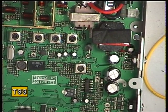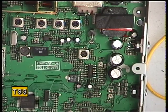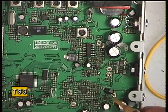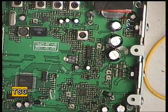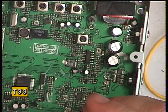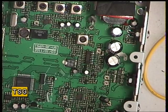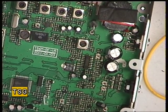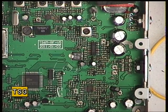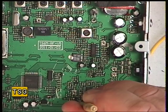The only other thing we can do is the deviation. This radio is never going to be used in AM. I think the adjustment W5 is the AM mod, but we're only going to touch the FM one, which is W7. Now adjusting the FM deviation — it was 1.7 as it came out of the box. It needs to be somewhere between 2.2 and never exceeding 2.5. Let's give it a quick whistle test — that's actually slightly over the top — and that brings it spot on.